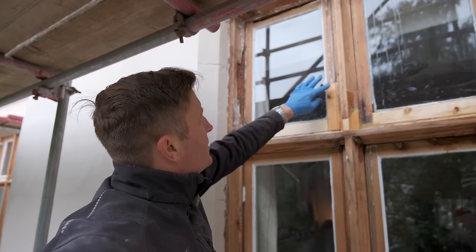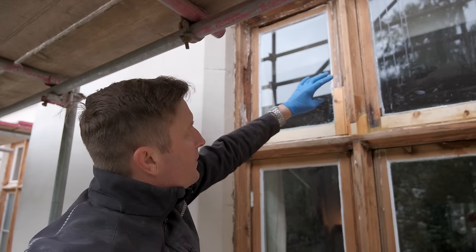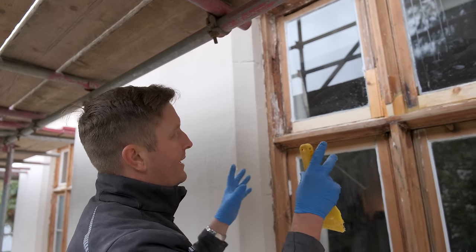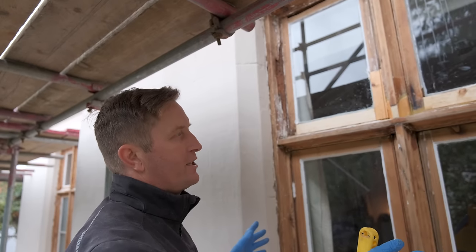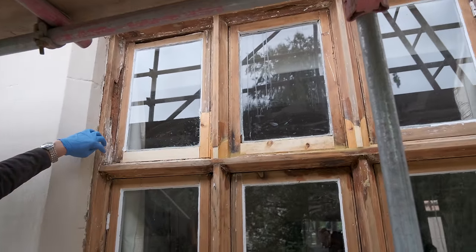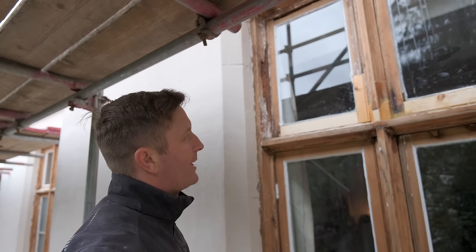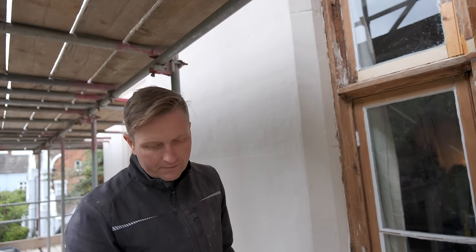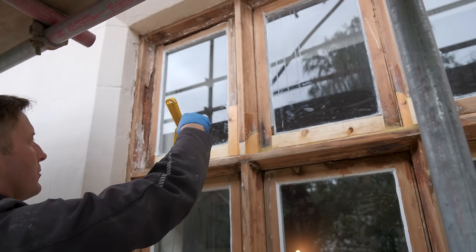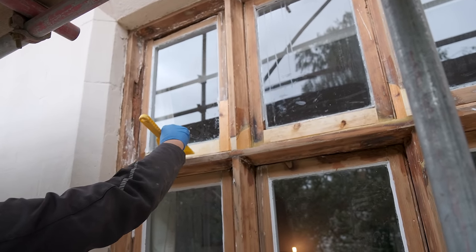It doesn't particularly matter too much if some of these areas are a little bit proud — I can come in with a sander and sand the wood down. Some of these edges here, I've got a belt sander that luckily enough fits this profile, so I can get right in there with that and it will come up fantastic. It's more important that I get the areas set first, and then I can deal with the individual areas one stage at a time. It's really important for all these areas along here where the water would normally sit to get sealed up properly, to have a nice bit of a ramp there so nothing like this happens again on this window. The wider scraper enables me to follow the profile of what the original window was, and hopefully should cut down on the sanding time.